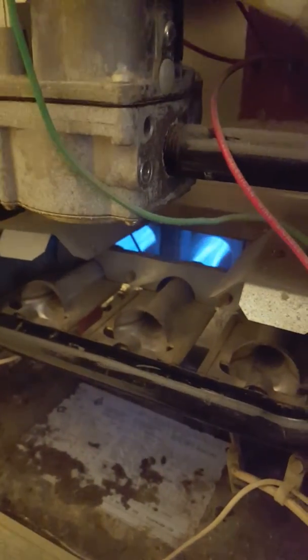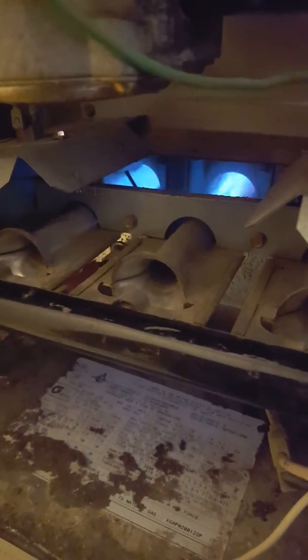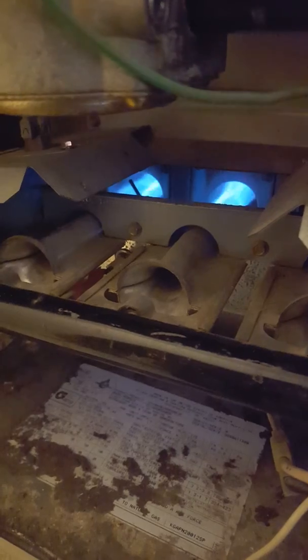It has a test period about this long. You can see the flame sensor — that small wire down close to the flame. If it does not register heat after a certain amount of time, the valve will close and the furnace will turn off. Most furnaces will then attempt to relight three times based on a timer. On the third failed attempt, the furnace goes into a fault mode and will not try to light again for another half hour or hour, depending on the brand.